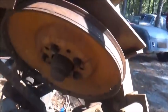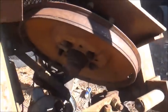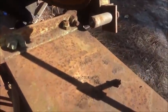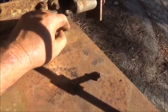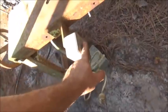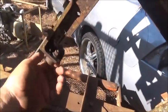And this was the same way. This is a lug nut. Chain drive off of a gearbox. There's a right angle gearbox back there. And there's a detent ball in here with a spring that holds it, and I guess holds it down or holds it up, or maybe it went right here and was supposed to hold it up. And it's set up so the switch knocks off when it comes down. And the guides, which are just regular roller bearings, this guide can move back all the way to here.